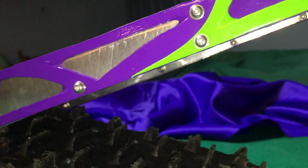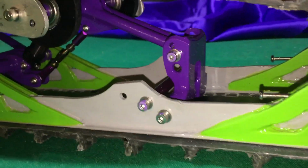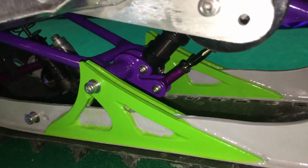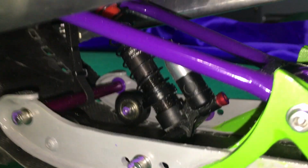And then it'd be light coats of base color until you get the color you want. And then for the last coat, you put a nice thick coat to make it nice and smooth. And then after that, you put your clear coat, and the clear coat is a 2K part clear coat with a hardener. And then that's it. You can see the cog there.